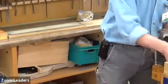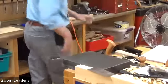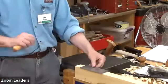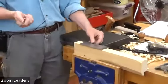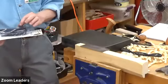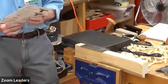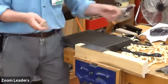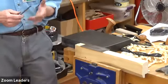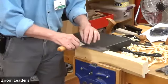When you want to get going, what you do is leave a little oil on it, and you consolidate the metal with a burnisher like this. This is another patent burnisher, which allows you to set a specific angle, and it'll do the 45 and the 90, I think. Haven't used it in a while. Otherwise, you take something that is very strong. We have burnishers here. This one is carbide. You want something tougher than this steel here,